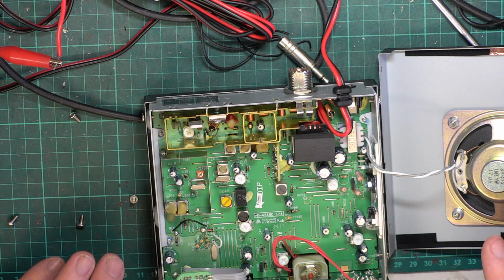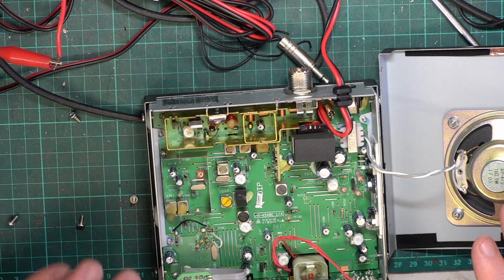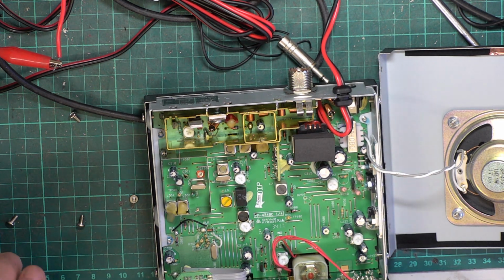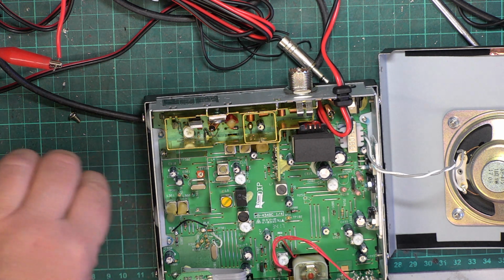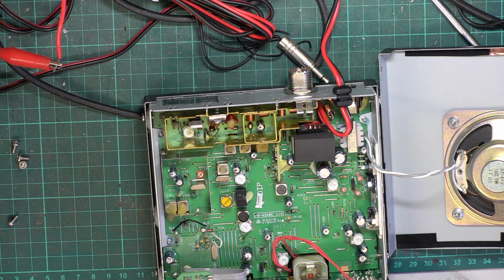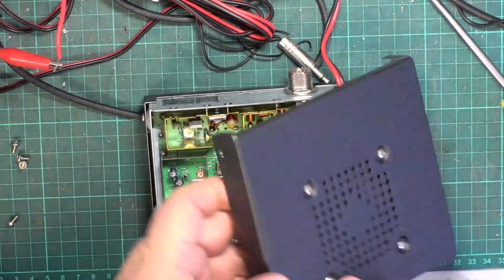The contactor's on the wall, right over the other side of the room, and all I have on the bench is a stop button. Once I press the stop button, the contactor trips, and the power to the power supplies is cut, and it doesn't come back on unless you walk over there and press the start button. So that's why we do that.